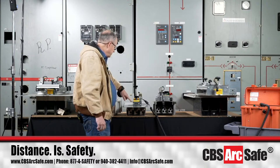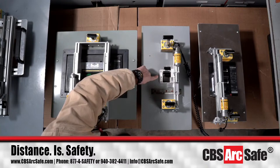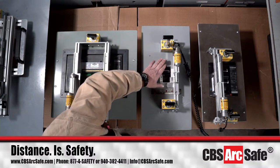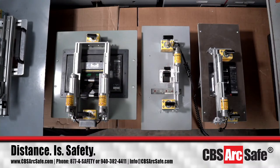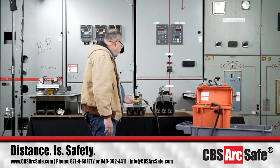The first one we're going to look at is going to be the RSA 113E. This is on an Eaton Cutler Hammer M frame circuit breaker. The M and the L frame have both the same face shape, so we can use one actuator for both of those. And so we use the RSO1 for this, and I'm simply going to power it on. We've got the circuit breaker in the closed position right now, so I simply hold down our trip button and our close button. And that's the simple operation of the RSA 113E.